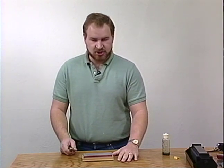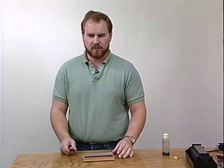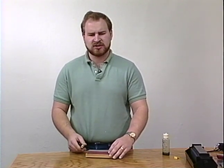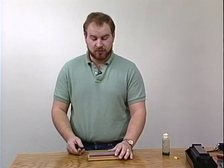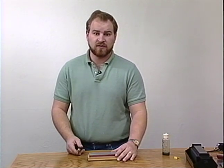This is what they call diamond — it's actually industrial diamond embedded onto metal. It puts a very fine edge on your material very quickly. You don't have to use oils — just use saliva or water. Be warned though: this takes a lot of material off the knife very quickly. If you want a knife that you spent fifty, sixty, a hundred dollars on to last a lifetime and maybe your next generation too, be aware of that. Same angle as before — it may not feel very rough, but it doesn't have to. They come in all sorts of colors — all this is is the base plastic that allows the diamond to be embedded onto. These will wear a whole lot longer than a standard stone will — it's diamond, a very hard surface. If you have a very hard steel or you're doing chisels, a diamond stone will save your Arkansas stones quite a bit of wear.